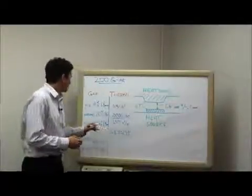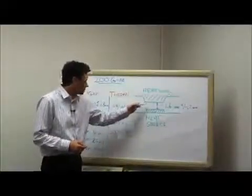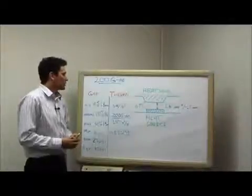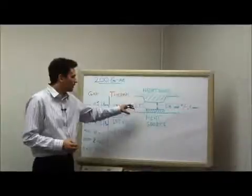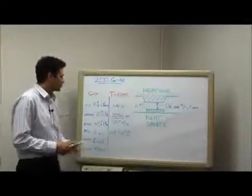At those compressions, we've got a force that can range from 16 PSI at 1.8 millimeters. We'll have a nominal of about 25 PSI, and if the gap is really small, at the other extreme of the compression, we're going to see about 40 PSI. It's important to keep in mind that these forces will relax after about a minute, but these are the forces you're going to see during the initial installation.